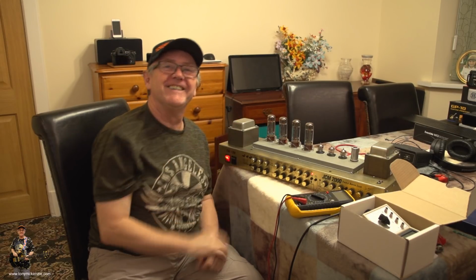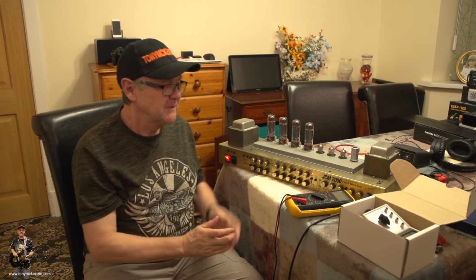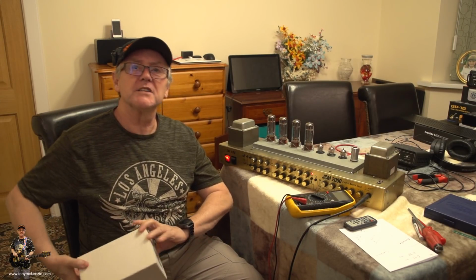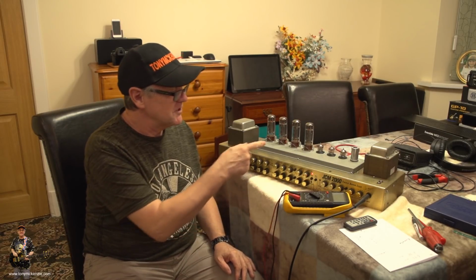Well, I tell you what you're going to do. You're going to go and measure it the other way, because it all says everything's good, and you go from there. So let's put the bias master away. It has its place, but your tubes have to be really nice, and then the bias master comes into its own. If your tubes are not so nice, or they're like these, get the old meter out and do what they said.